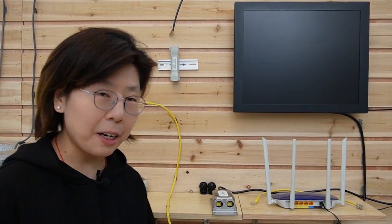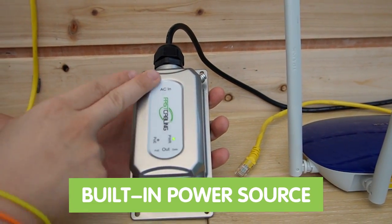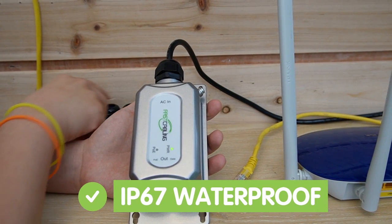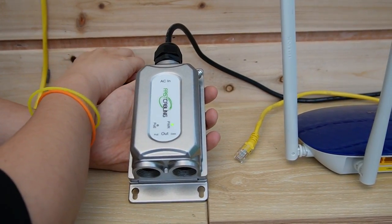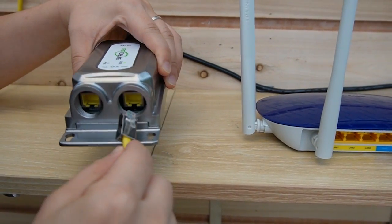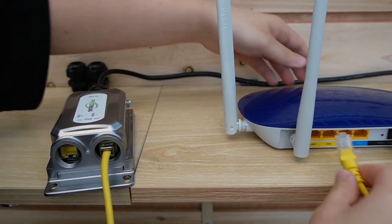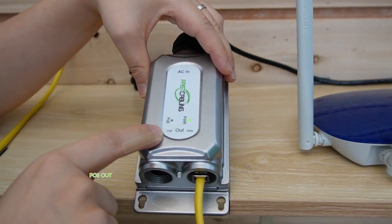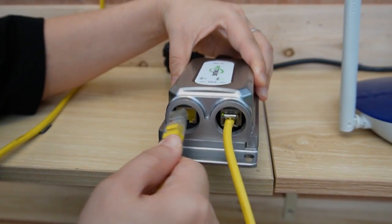Let's do the connection from the beginning. This is the 60-watt PoE injector — it has a power source already built in and plugged in, so you can see the light is on. Also, this is 100% waterproof. I took out the neck and gland for faster installation, but in a real connection you should add these. Now I'm going to use a short patch cord to connect our router with the injector's data port. Make sure you plug this into the main router. And this is the PoE output port — I'm going to use another short patch cord to connect it with the PoE extender.